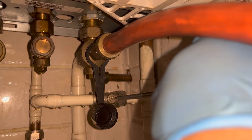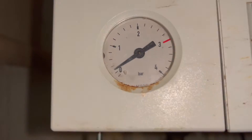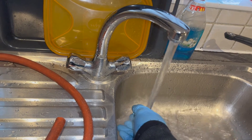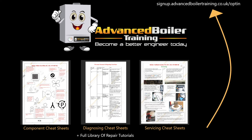Now we need to do the filling loop — they've got an isolation valve as the filling loop which is a rare thing to come across, but I'm going to fill it up to 1.5 bar, make sure it's all good. The water's staying hot, it's not overheating, the boiler's looking all good — just going to do my safety checks and then this job is done. Hope you enjoyed it — if there are any questions let me know in the comments. If you're an engineer and you've done something differently, let me know, I'm always looking for new tricks and hacks. See you in the next one.